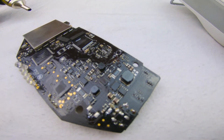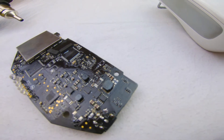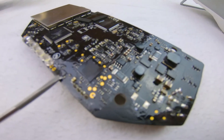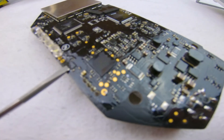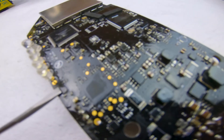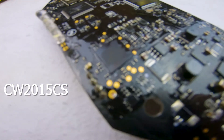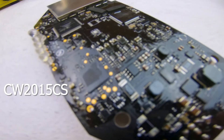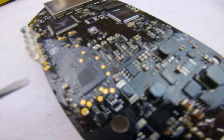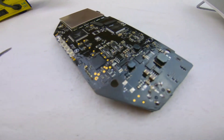I've got a theory that heat is loosening up a bad solder joint. After doing a bit more research, some people suggested this chip right here, next to the LED charging indicators, is the chip at fault. I got a jeweler's magnifying glass, took a look, and got the number off it. I looked it up online — it's a chip responsible for checking the charge state of a battery. You can buy them in bulk online, they're really cheap, but they're still very small and hard to replace.